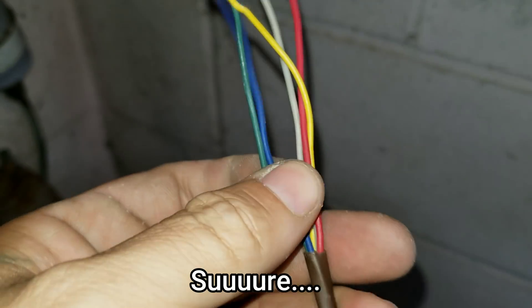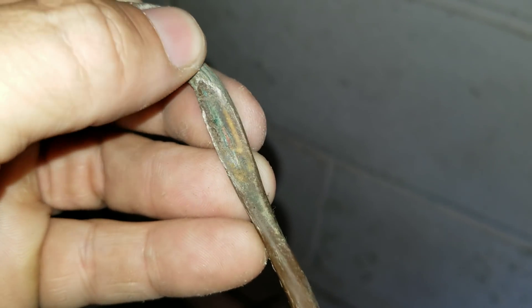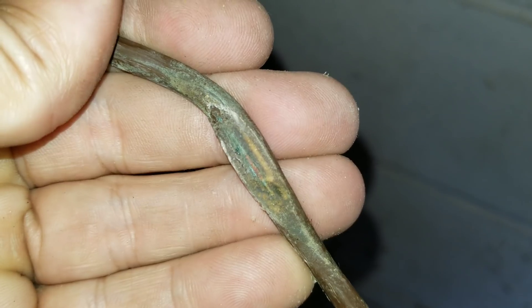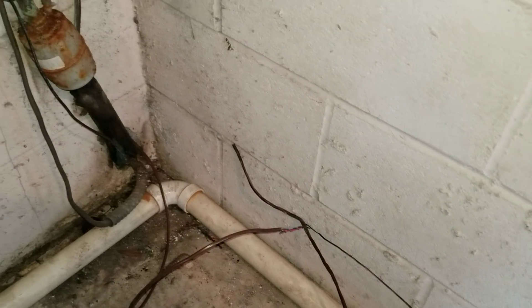It's only four wire running outside, for whatever reason — but actually it's five wire, and since this is a heat pump, all five conductors are being used. It looked like it was the green wire that was exposed — you can kind of see that green wire running through there with the exposed copper. I'm now confident that this is what has been blowing the fuse intermittently over the years.